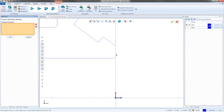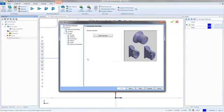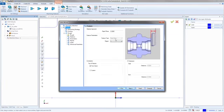It wouldn't go any further into the stock or above that line or below that line unless you added extensions, or really, we didn't even have extensions then. You had to add leads. When we're doing a lathe end face, all we're really looking for is where do we need to stop. So did I pick the right one? Yeah, front face. So it picked the line, and basically all that line's there for is not telling it a length in X. It's telling it where it needs to cut to in Z.